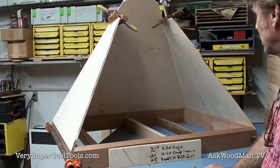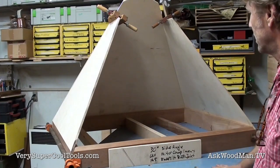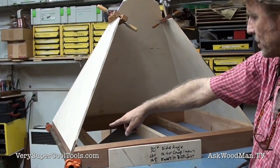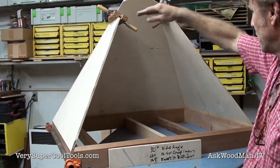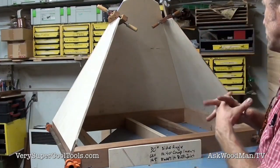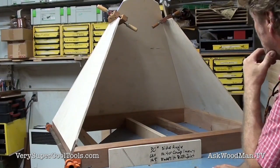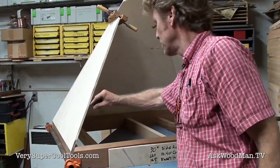It's already 6:30, so I could probably go for another hour. It's going to take me that long to get this piece done and get cleaned up. Then I'm going to trim all these pieces on the table saw — I've got a uniform dimension down here so I can tilt the blade over and just run them all with the fence. That'll give me a really good place to work from. Then I'll get my cleats going — just some one-by material — and do some ripping work.